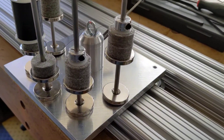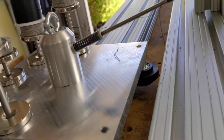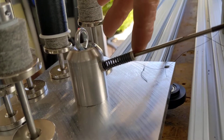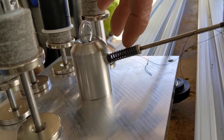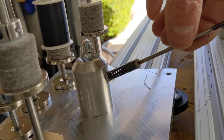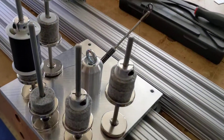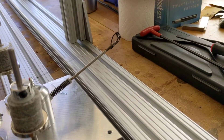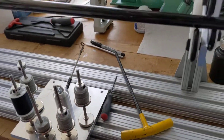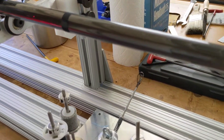The thread goes through a common big eye here. Then I machined out a hole, put a sleeve in there that fits a spring, and made another piece that fits on the spring — kind of press-fit. This is a piece of three millimeter shaft so it can take a tip top, and the tip top creates enough spring tension to hold the thread. This whole assembly can roll down the entire length of the wrapping stand so you can wrap from butt to tip without having to index the rod at all.